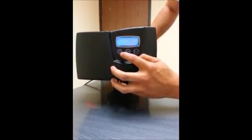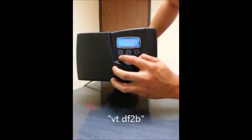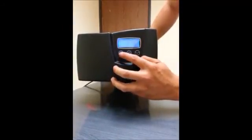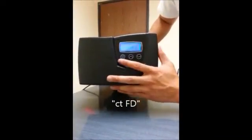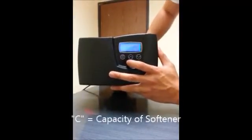The DF GAL should be left alone — skip it by hitting the cycle button. The next setting is VT DF2B, which shows this is a double backwash. You can skip that as well; it's already a default setting. FD is the correct setting for the meter valve.